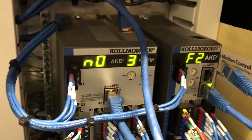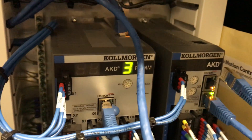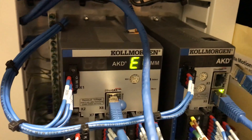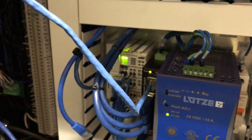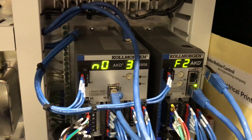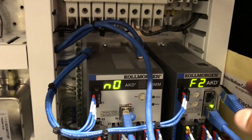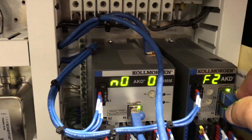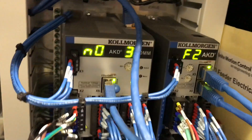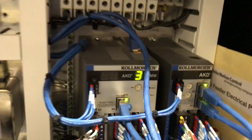There are other codes as well. Another one that's common is E33, which means that the configuration isn't what is expected — for example, the remote I/O isn't in the communications link. So these are the codes and where you can find them. Now we have this E33 fault. I'm going to restore communications to the proper connections. This fault can't be cleared — we have to cycle power.